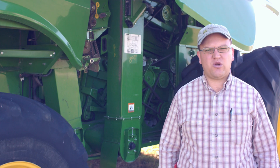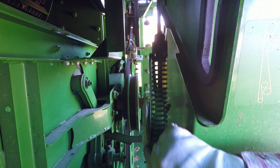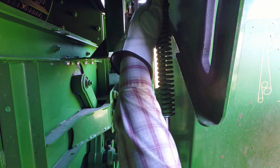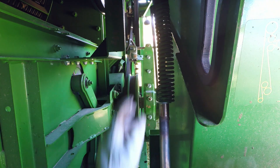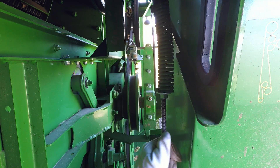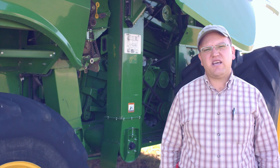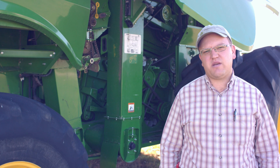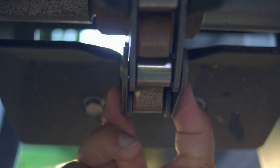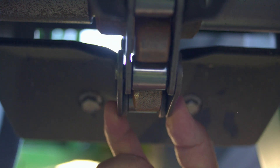Once you know the elevator chain is in good working order, go ahead and re-tension the elevator drive belt. Then inspect the amount of slop on the chain at the lower sprocket — you want no more than three-eighths of an inch of pull down off the sprocket, but no tighter than what would allow you to slide the chain from side to side.